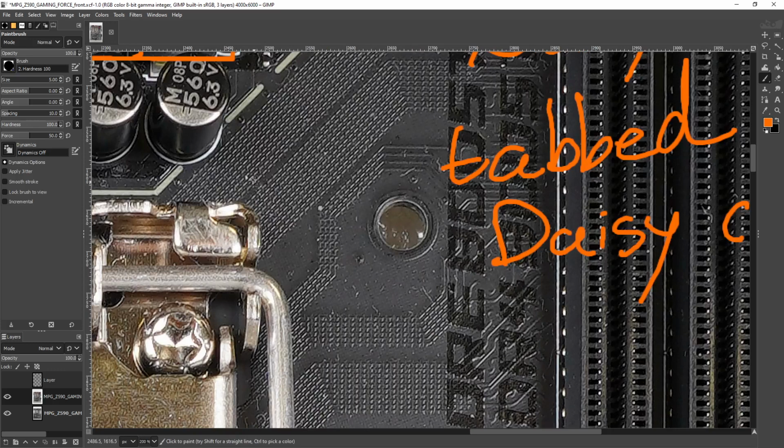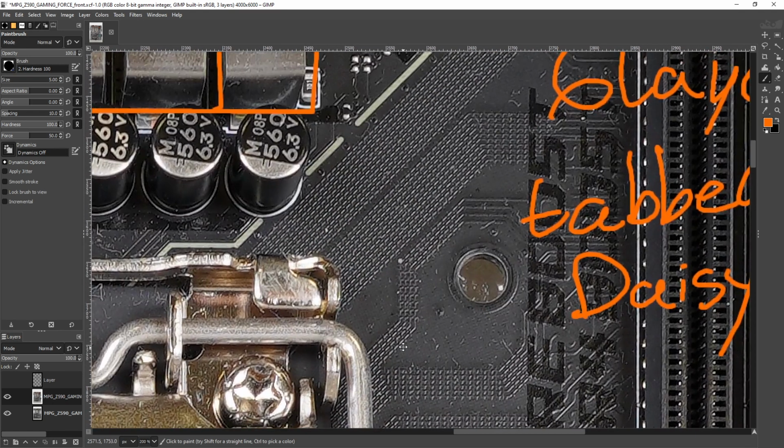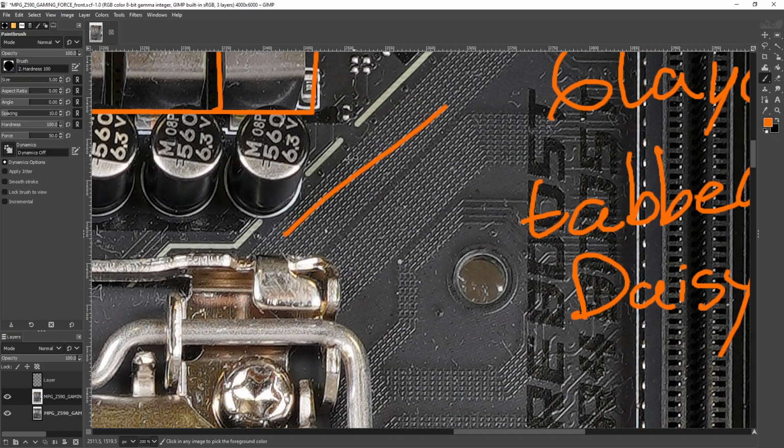with. So you'll notice that these memory traces up here look very funky. They almost look like they're going for a carbon fiber texture, but that's not what they're doing. What they're actually doing is, if you have your memory traces something like this, these traces have little tabs hanging off of them. And the actual tabs on the board are more like trapezoidal shape rather than little lines hanging off. But I'm not going to be drawing little rectangles here, because that would take forever.